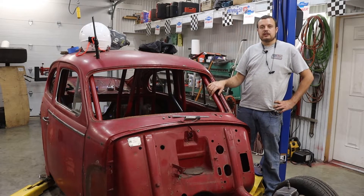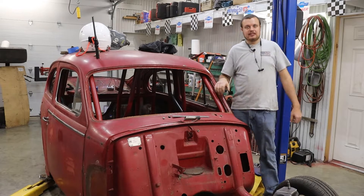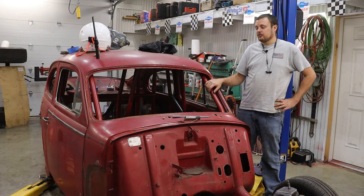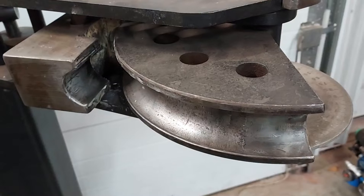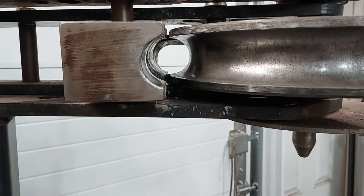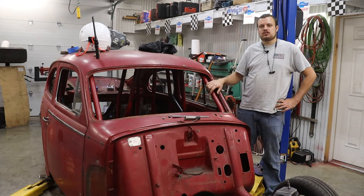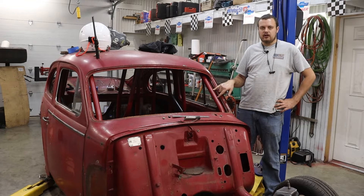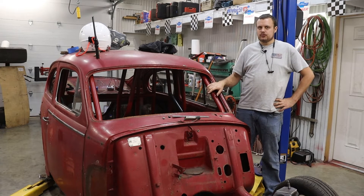Here are the tools you will need. First off, you're going to need a tubing bender — you're not going to bend these tubes over your knee. You need a pretty hefty piece of equipment to bend the tubing into the shape you need. You also need the dies in order to bend all the different sizes you may be running. In our case, we only have an inch-and-five-eighths die for drag racing, which is the main size we'll be using. All smaller diameter pipe will just be straight sections, so in most cases you can get by with that.